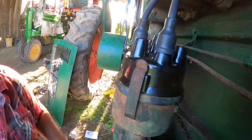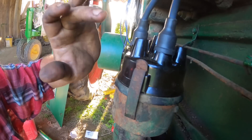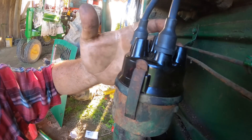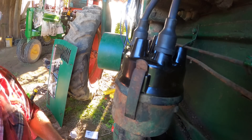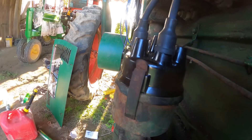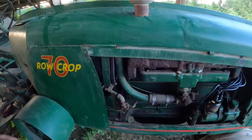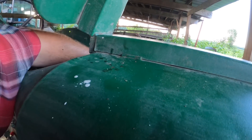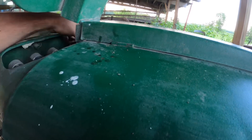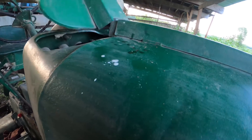I probably explained this before, but I use these cheapo pliers to do the final crimp because it keeps the thing round — it's got a slot for this. One five — that one goes here. Will this slide down easier than that other one or is it going to be the same trick? Probably going to be the same. Slides up, doesn't slide back down. Come on now. Now we got two of them in — one five three six two four. So that'll be the next one. The camera got too hot and shut off but I got that done, so here's the moment of truth — let's find out if it will run or if we made it worse than it was before.